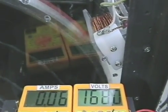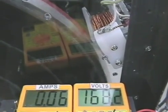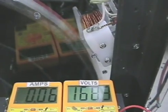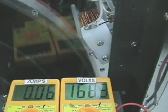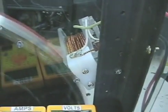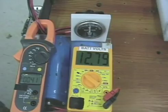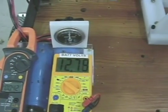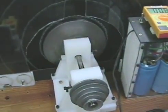Okay, the wheel's mounted and I'm running one coil just to see how effective it is. It's 0.06 amps at 168 volts, and one coil is pushing the wheel — not a problem. The output is 430 milliamps into the battery pack. So one coil is enough to push the wheel.